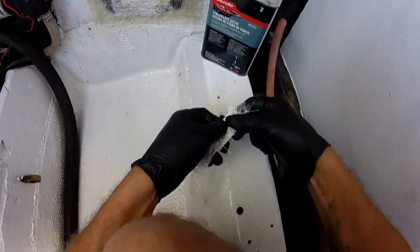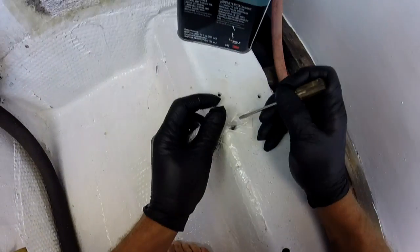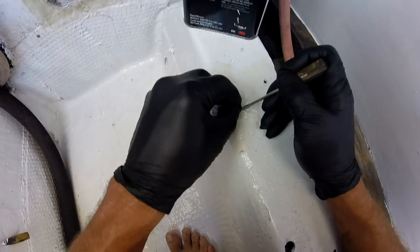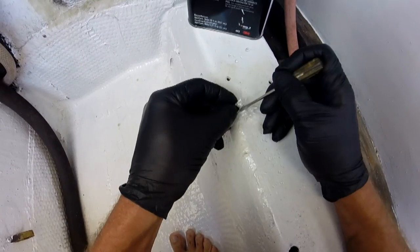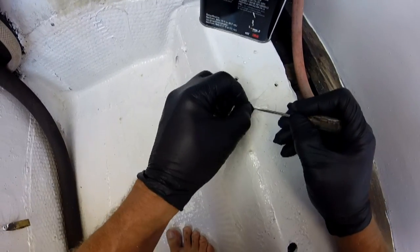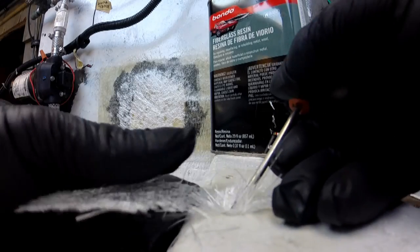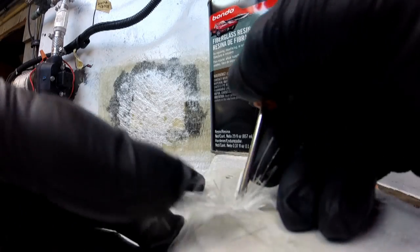Here you see the fiberglass work that I had to do after I did get the place painted. I covered up that hole on the bulkhead, and the holes where the old engine mount had attached all got filled by stuffing that fiberglass in there. And later on I just poured some fiberglass onto those holes, hoping that it would weep all the way down and make a nice strong fix for that.